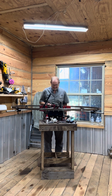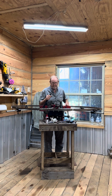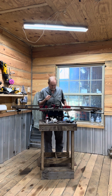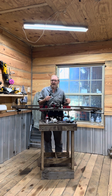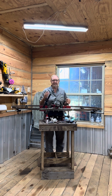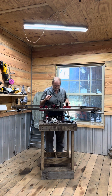This is where my weld joint is. So I checked right here. I just set those. These Wood-Mizer turbo blades usually do a pretty good job on keeping the consistency of the teeth in the right order, but I always check. I check every blade, no matter what company makes it. Wood-Mizer's good. Timber King is good. Rippers were good. But there's a couple of companies out there that don't pay particular attention to that. And if you're not careful, you will mess up.